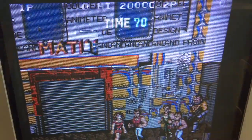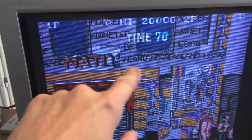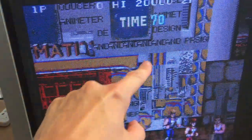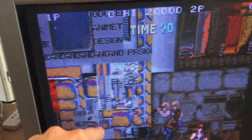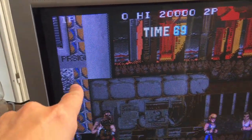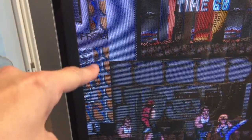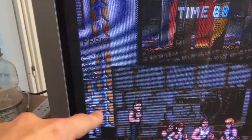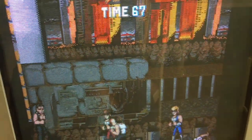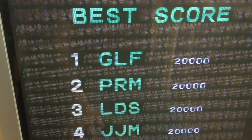There is something funny going on up here on the house, where you can see some sort of text which is not supposed to be there. And here you have an area which looks completely scrambled. But over here you can also see that there's some regularity. You can see maybe that this background graphics probably consists of small tiles, because they are repeating themselves like over here. Everything actually consists of small tiles, which are I think 16 by 16 pixels large.